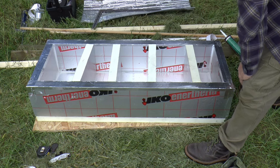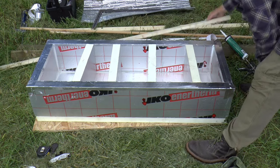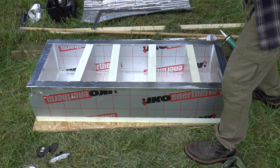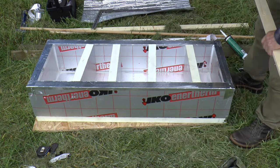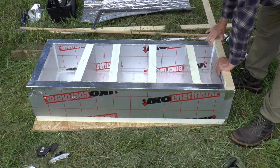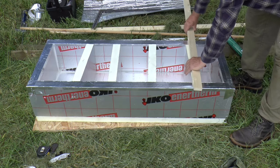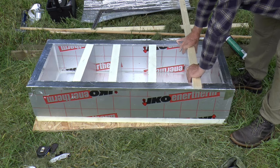So the next thing is going to be cutting this stuff, the 47 by whatever it is. It'll say on it somewhere, here we go, 19 by 46 in fact, not 47. I'm going to be cutting that into four 50mm sections. Two are going to be fixed to the ends like that as stops, and then each of these dividers are going to have one section attached to it